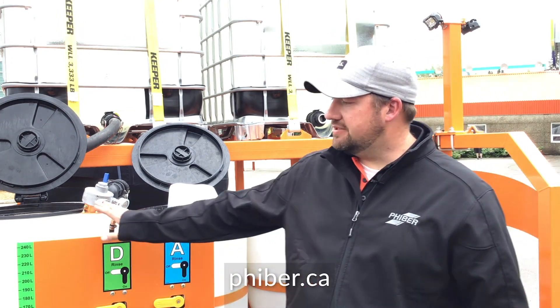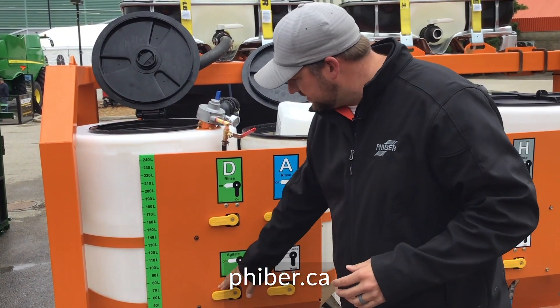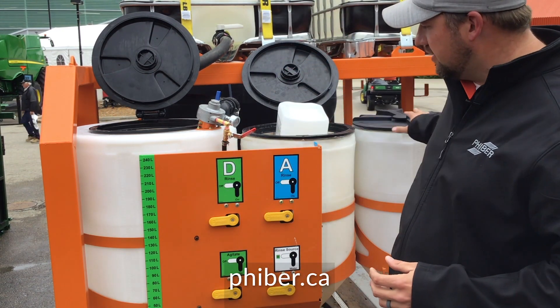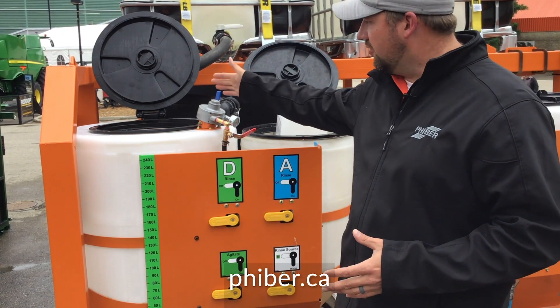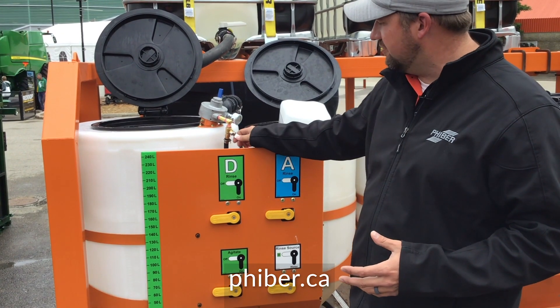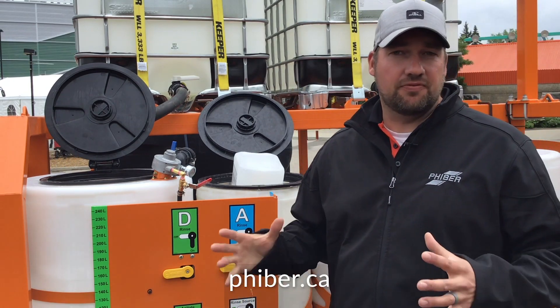To do dry products, this inductor is set up with an agitation system in it. For smaller rates — say 8 pounds or something like that per load — you can just throw your packets of herbicide in here. There's an agitate hose in the bottom using that air diaphragm rinse pump — you just turn that on and the air-powered pump will stir it up. For high amounts of AMS or dry fungicides — up to 100 pounds per load — there's a whole blender system you can install that is quite aggressive in how it blends, really mixing it up to get all dry products into suspension before sending it to the sprayer.